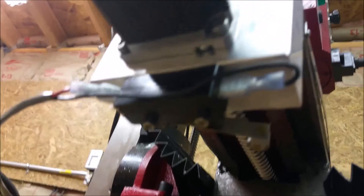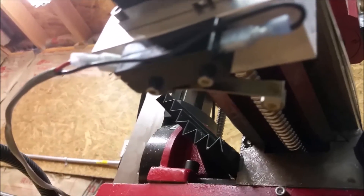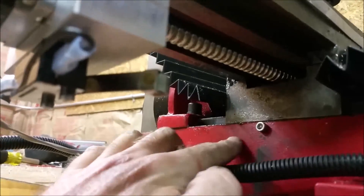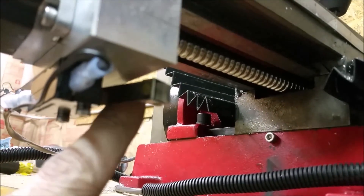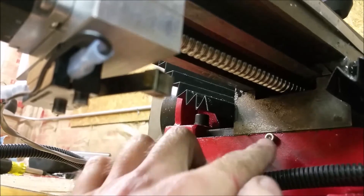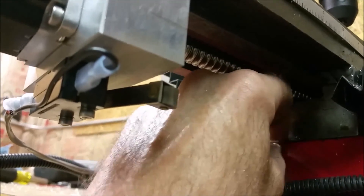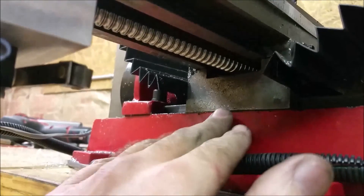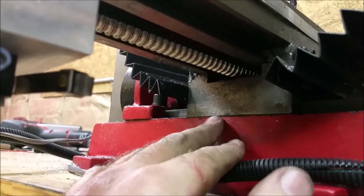I got my X-axis switch mounted. I just attached it to the bottom of the motor mounting plate for the X-axis. I ran the wires and connected them there. All I did was put a screw in where this comes into contact — that hits that screw. I can adjust this by backing it out and putting some washers in there to adjust it. That's what I'm using as my adjustment — washers if needed. Actually, I don't think I'm going to need it; I've just got the screw there.